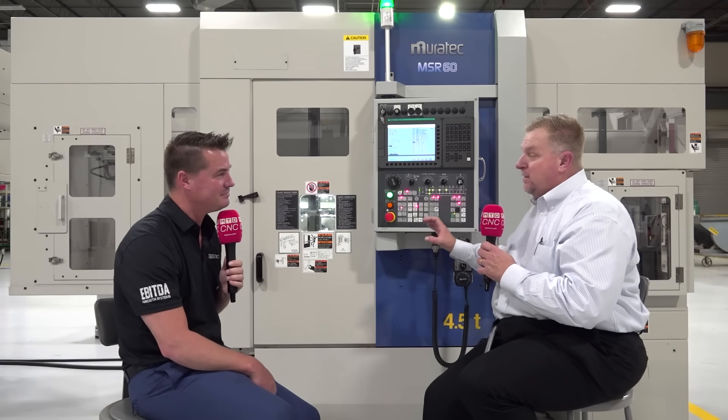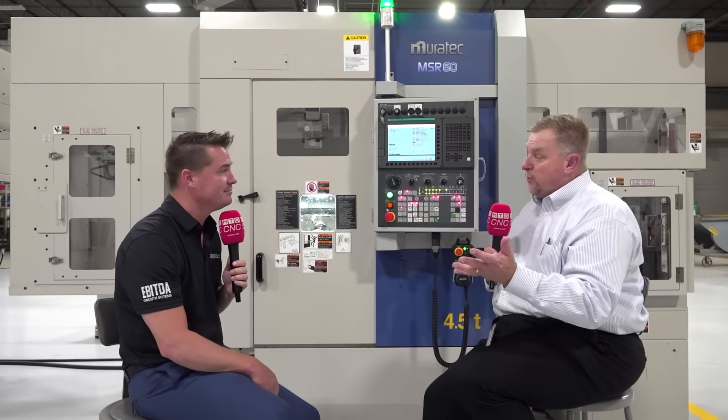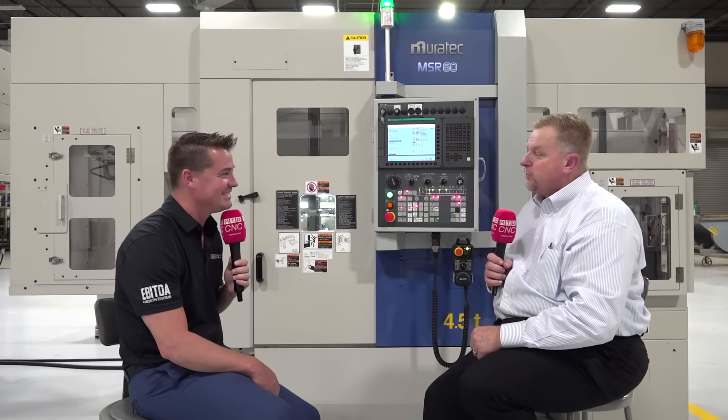We have a lot of milling capability here without having to transmit to a clutch or a series of belts to get to that live tool, like you commonly see in other machine tools. And traditionally we lose a lot of power in that relay — typically somewhere around 30%. You can tweak it and gain five percent, but the reality is to get to 99.5%, you must be direct drive.